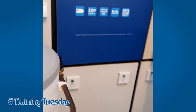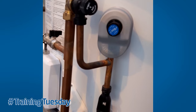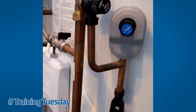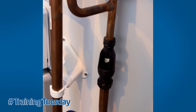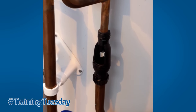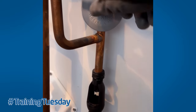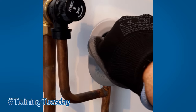Then, all we need to do is go back to the hot water cylinder to the temperature and pressure relief valve, which is located here. Then, all we're going to do is rotate that valve a little bit to the right anti-clockwise to release the water into the tundish like this. You can see the water flowing through the valve and into the tundish. Depending on the size of the cylinder, this will take anywhere between two to three minutes. When no more water comes out, all we have to do is turn the temperature and pressure relief valve clockwise to make sure it's closed.